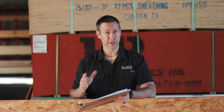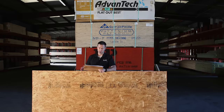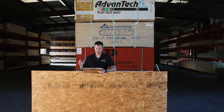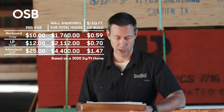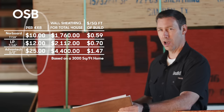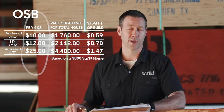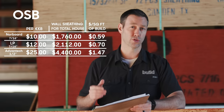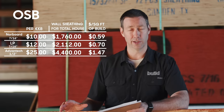There are a bunch of different flavors of OSB. When people talk about commodity OSB, the least-cost option I could find — and note these prices are from December 2018, so check locally when you're watching this — Norboard is going to be about $10 for a four-by-eight sheet. LP, which is that orange bundle behind me, is a slightly nicer grade at about $12 a sheet. The top-of-the-line is Advantech sheathing, a true half-inch sheathing running about $25 a sheet. To extrapolate to a whole house cost for a 3,000-square-foot two-story house with an attached garage, that's framed square footage.